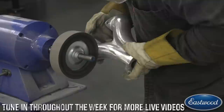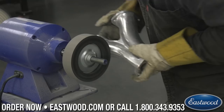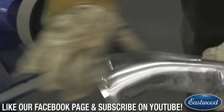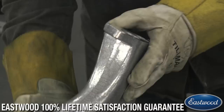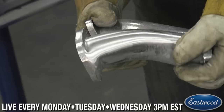Alright, almost there folks — we're fairly smooth in this area. Let's compare what we started with: all these really rough grind marks from when they were making this, almost like cut marks from a cutoff grinder. We're going from rough casting marks and heavy lines like that to what we're coming up to now. I've got one more grit — 3000 — and then I'm going to put a little white rouge on this and see if I can polish it up.